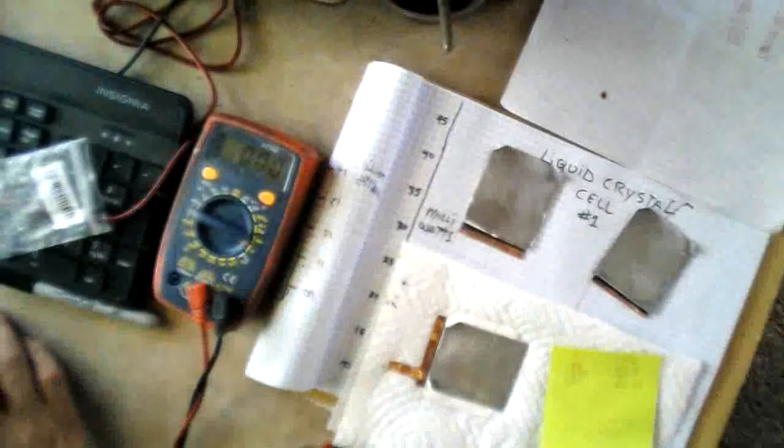On these test results we're up to almost 60 on this one, and I think it finally went dry. I'll chart all this out — I'll have to tape a piece of graph paper up here because it's way off the scale now. I think the thicker one dried out faster, so when I rebuild this I'm going to stick it in a little plastic bag. That'll seal it — seal the water into it — and keep it from drying out. That should extend these things quite a ways longer, and then we'll see what we get. I'm betting we get a lot better cell out of it. Looks like the testing and research update will be next, and then I'll come back with the cell rebuilt, cured for a while. Thanks for watching.